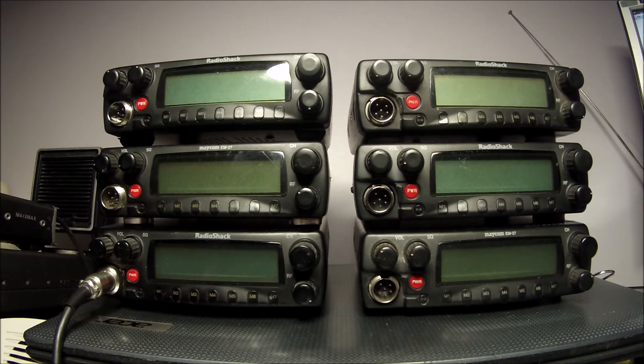The area the battery leaks is right next to the 5 volt regulator and the receive and transmit switching transistors. Once you have established which components have been eaten away, they are easily replaced with more discrete components rather than surface mount components.